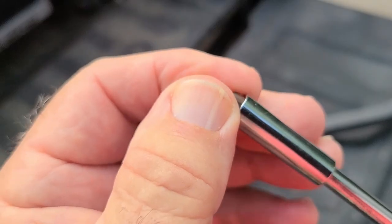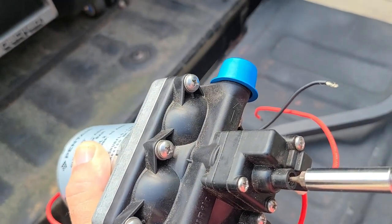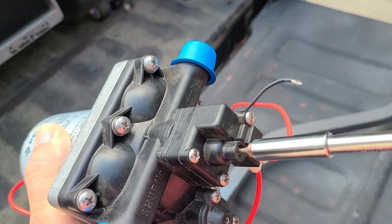Normally you get a 5/64th bit and adjust this little screw. If your pump is running and it won't shut off, try turning this screw a quarter turn counterclockwise until it does. If it still doesn't stop, try another quarter turn counterclockwise. And if that doesn't fix it, you'll probably have to do what I did and change the pump.